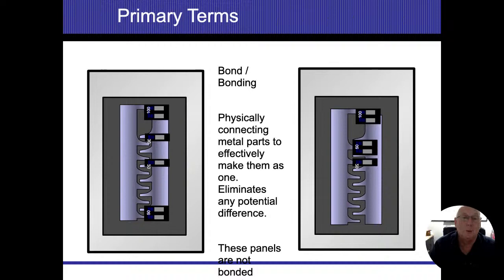So what we need to do is get that electricity back over onto the neutral. My main bond connects my grounding system to my neutral system. My grounding system will only flow 5 amps, not enough of a flow to trip the breakers. So I need to have unlimited flow of amperage to allow that breaker to trip.